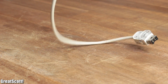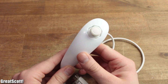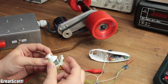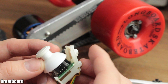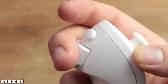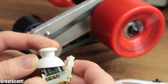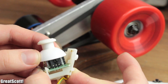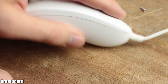Now the only thing left to do was to create an easy-to-use remote for the transmitter. For that I started off with an old Wii nunchuck that I had laying around — it's an ergonomic design and I can use the analog stick as a potentiometer. The Z button will act as a safety trigger, meaning no signal will be sent out while this button is not pressed. The C button will act as cruise control, keeping the current speed no matter how you position the potentiometer.